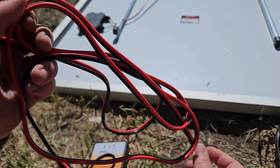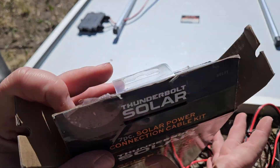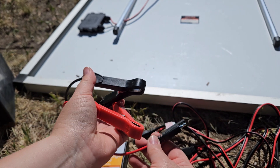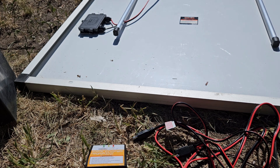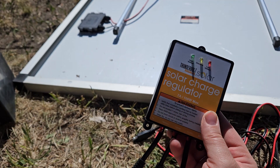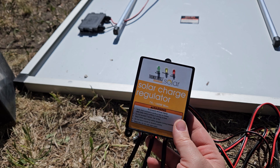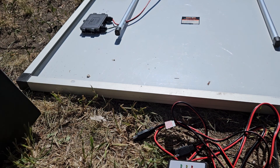This is an extension cable — really nice to have. This should only go from the solar panel to the charge controller. This comes in the solar connection kit. This connector goes on your battery. As I said in one of my other videos, you always want to connect the charge controller to the battery first, because you don't want to overload the battery or the charge controller. So go ahead and slide it in — it is going to be hard the first time around.